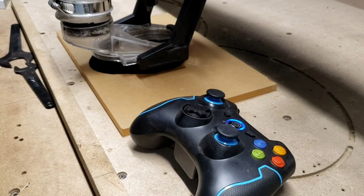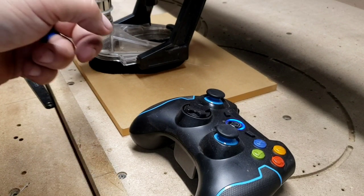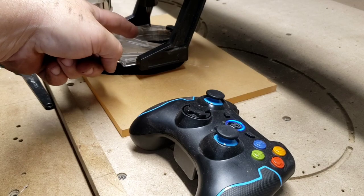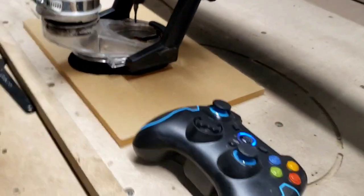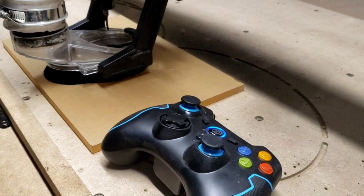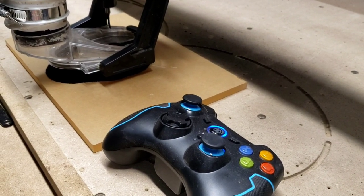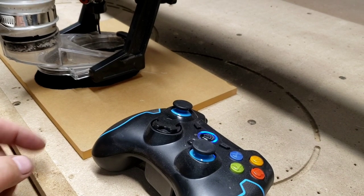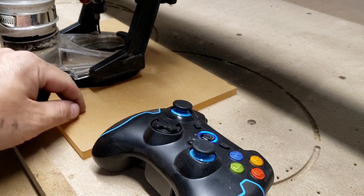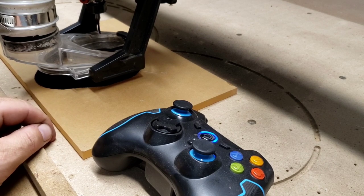All right, I got the machine zeroed out. I got it also set to the center of my material. Show you my little crosshairs. I also set the Z height with my probe, so I got the correct height. I also did cut 0.001 inches deeper to make sure it goes through the acrylic but not through the sheet, so it shouldn't even leave a mark on my board.